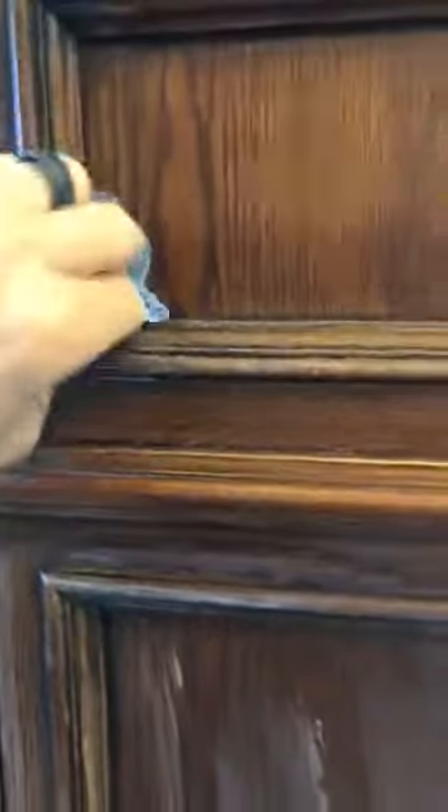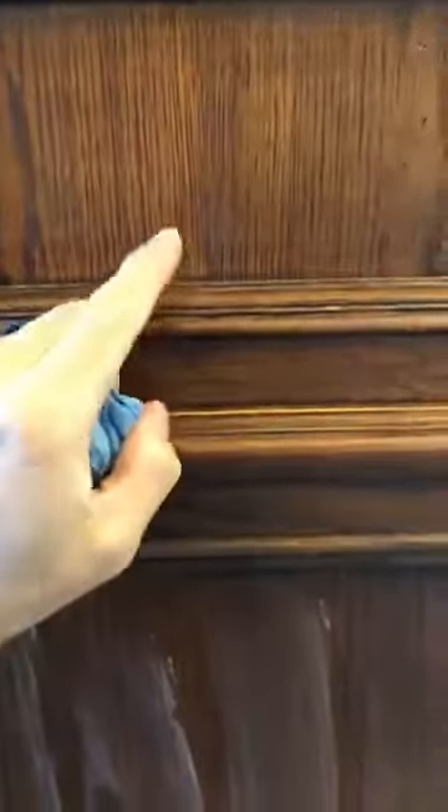Once that dries, if I wiped correctly it should stay the orange wood color — you shouldn't see any more of the white residue. If you still see white residue, go through this step one more time. Whether it's dust from the wood or oils and residue from years of polishing, you want to make sure you get all of that off. You don't want a barrier between the wood and your paint.